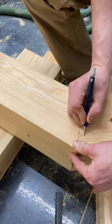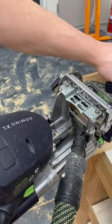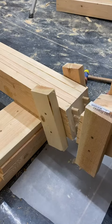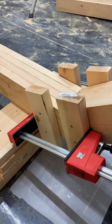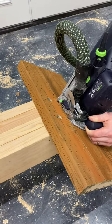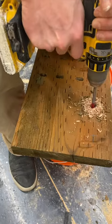The beam would be supported on the concrete floor on one side and on the other against the wall. I joined sections of the beam together using Festool dominoes and glue alone. The end of the beam which would be down against the concrete used a pressure treated 2x10, attached to the beam using 9 dominoes and anchored to the concrete using concrete bolts.